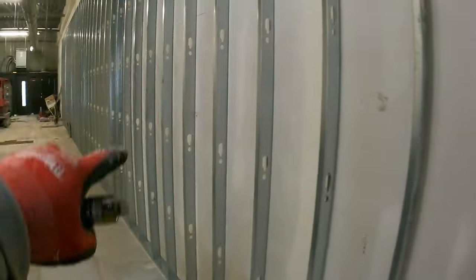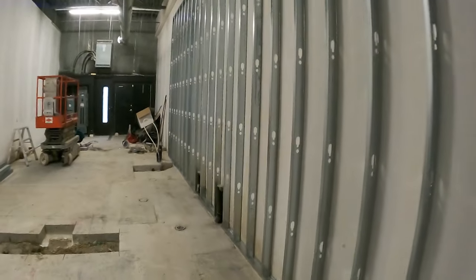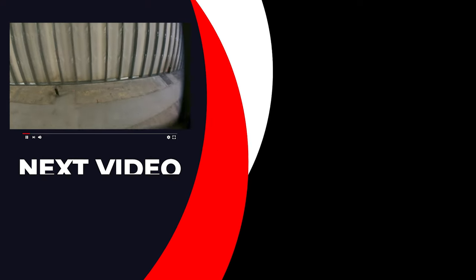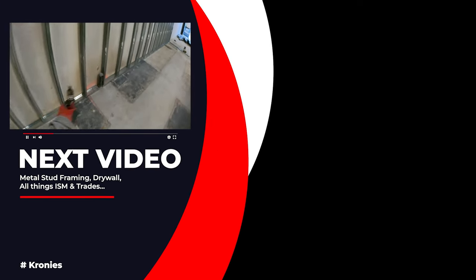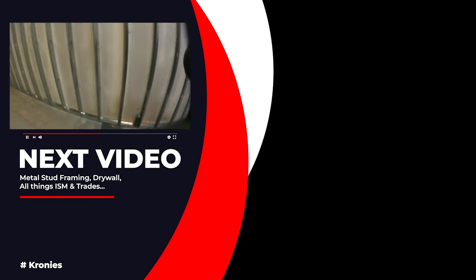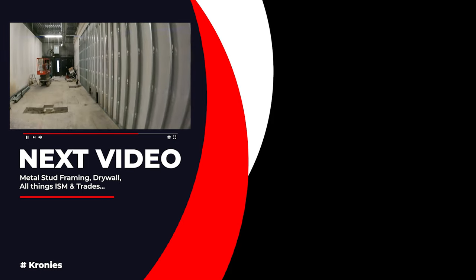This front wall goes all the way up, and this is the bulkhead side. All the bottoms are screwed in. I'm going to go in and randomly put some inch-and-a-quarters in for extra strength. No channel in here — it's a furring wall for plumbing, so we're going to leave it open for the plumbers for now. It's nice 20-gauge steel, super sturdy. I just stopped the track on either side of the plumbing — the 16s worked out perfectly so the sheets will land very nicely.